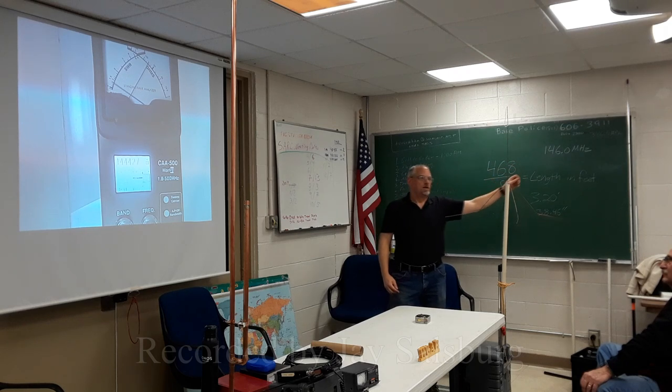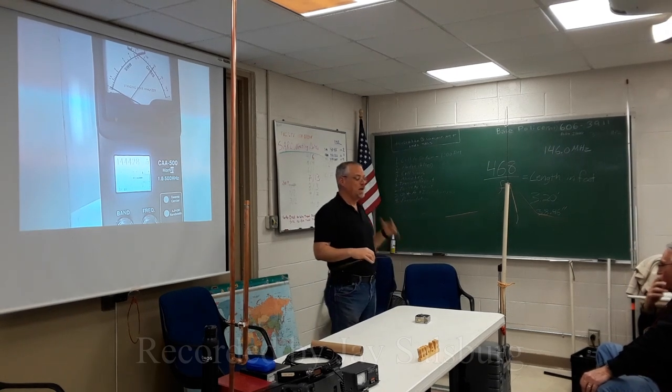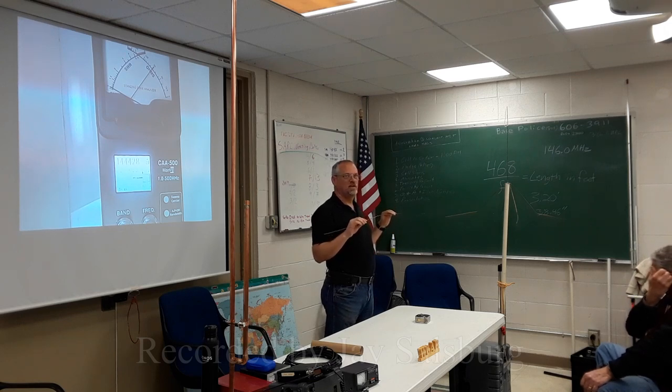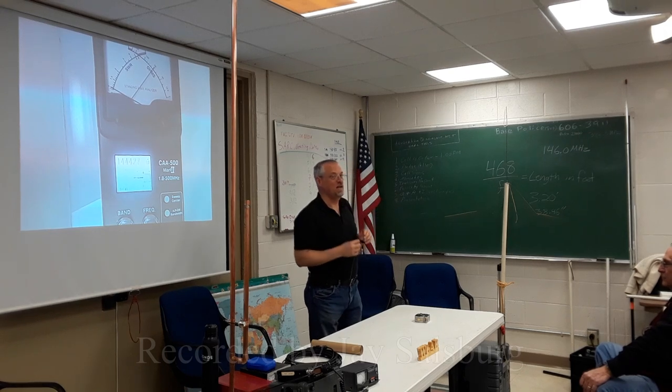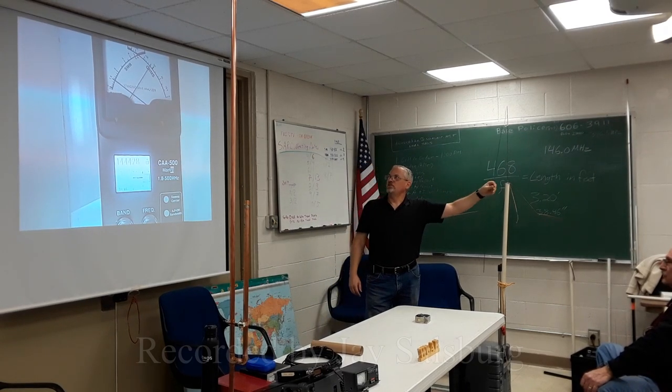Yeah. Right. So, again, one of the things that's really important, especially I've learned this when I've done a lot of operating in the field, is trees in particular, green trees especially, are not your friend. Don't hang your antenna in a tree. That might be the only thing you've got to put it up in the air. Low frequencies are okay. That may be true, but get your antenna away from it as much as you can. You know, there's ways you can do that. So you can see just how much that matters.